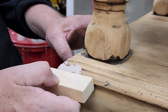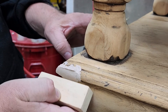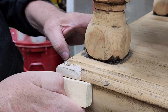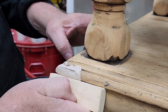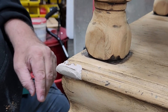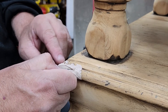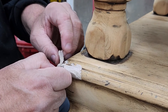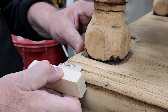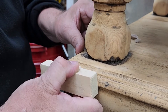Now I'm going to use this very sophisticated tool: a block of wood. All I'm doing is transferring this shape from the existing piece onto my moldable epoxy. It works very much like clay. I have excess, so I'm going to take a razor blade and cut off a little bit of the extra. I work from the bottom up, pressing on the edge — nothing complicated, nothing difficult, easy to do.